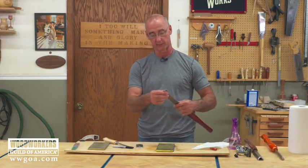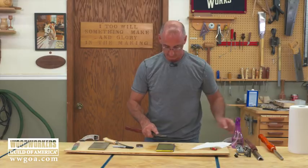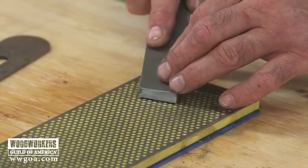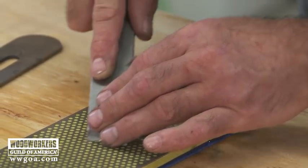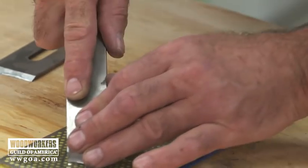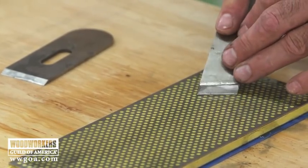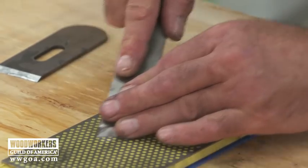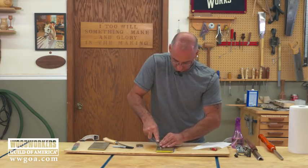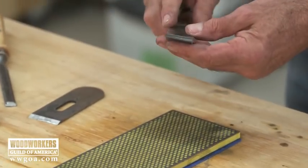Let's go to the world of turning — how about your skew? Same idea, a little more water. With the plane iron and the skew you can take that felt tip and color them in too. Puddle, flat, stroke. Part of the difference with our skew is we're beveled on two faces. So flip, puddle, flat, stroke. We're really doing pretty much the exact same thing that we did to the bench chisel and the plane iron.